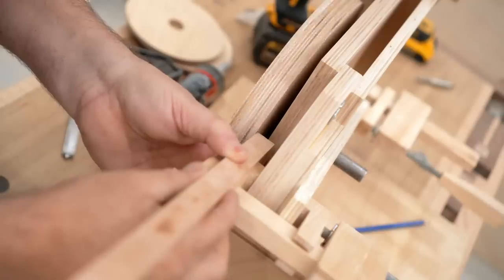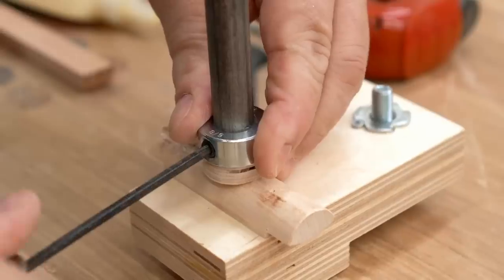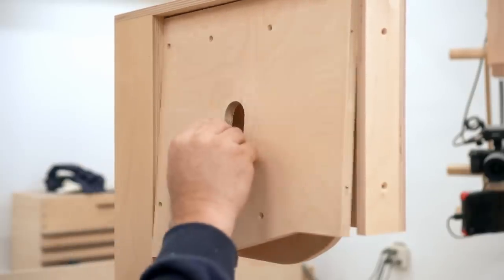I got a strip of wood so you can see there's very little wobble. I took the upper wheel off along with the upper wheel mount and decided I should have a spacer behind that inner stop collar so that it doesn't come loose and work its way back.